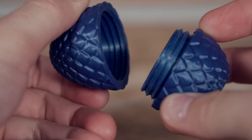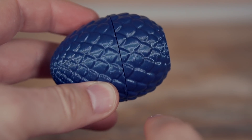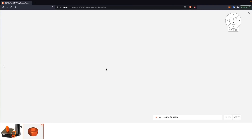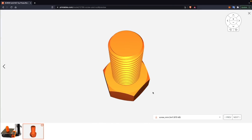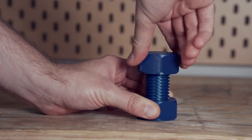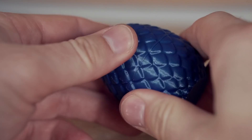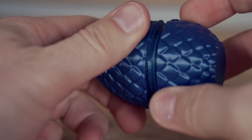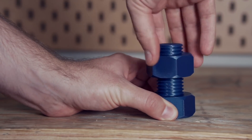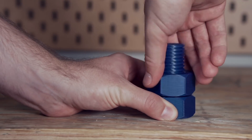I re-sliced at a slightly slower speed and 0.16mm layer height, which was a bit better, but I still wasn't able to thread the model entirely. I then printed a nut and bolt model I've done many times before — same result, the nut would not thread down the bolt. I then opened the Voxelab slicer and re-sliced the egg, and this time it was much easier to thread. I also reprinted the nut and bolt, and that threaded completely. I'm not entirely sure what factor in the Ender 3 S1 profile wasn't playing nicely with the Aquila S2, but I'm happy it was a slicing issue and not the printer failing to hit those thread tolerances.